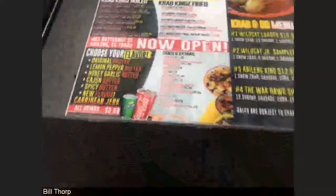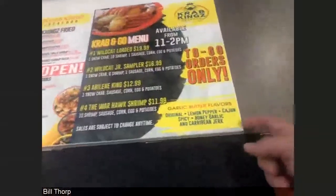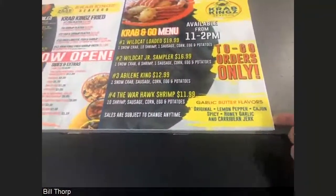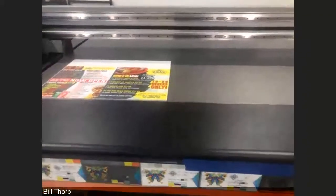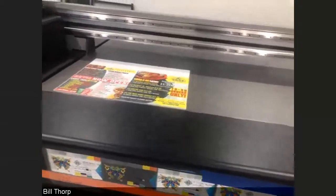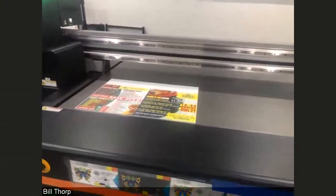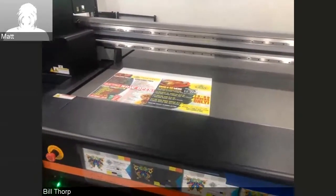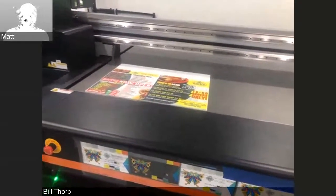So it's got the vacuum on, so the vacuum's holding that media to this table. I can't move the media. It's stuck. I'm trying to pull it up and it's not coming up. You've got four different sections for the vacuum, and what she was saying is, if you turn off the vacuum to the right hand side of the table while you're using the left, it amplifies the vacuum on the left hand side. So if you really want it held down firm, you can turn off the other areas.